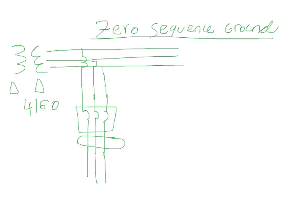It's a pretty hefty CT. What that does is, if there's a ground fault, it'll sense the zero-sequence current. Now, even if the system is unbalanced and there's no ground fault, it will not pick it up. If there's a phase-to-phase fault, it will not pick it up. Zero-sequence has to do with ground — it'll only pick it up if there's a ground fault. If the system is operating normally, you're not going to have any output on the secondary of the CT — nothing coming out of X1 — because everything is fine and the CT is not sensing any zero-sequence current.